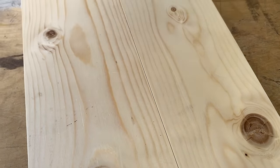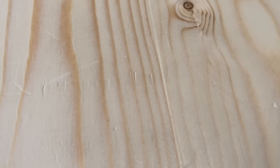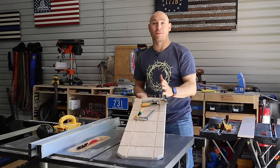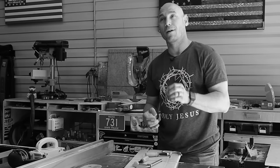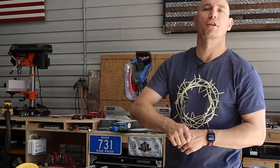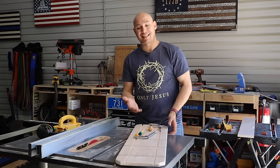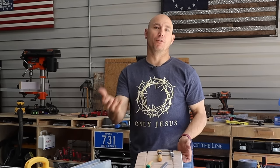For speed and convenience, obviously the jointer is going to win. Once you clamp these together, the gap goes non-existent — mash them together and then you can slide them apart. I really like that this sled makes perfect flat edges — they come together perfectly. As long as your blade is 90 degrees to your table and your board's not wobbly, the sled's the way to go. The taping method also works really well; you just have to stick and unstick every time. But that's an option if you don't want to do T-tracks or the Micro Jig match fit system. Now that I have this sled, I can use it for multiple uses: tapering, high fence, and jointing. It's the winner because you can actually do more than just joint with it.